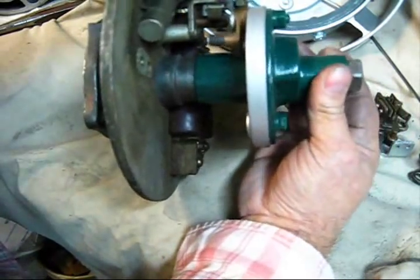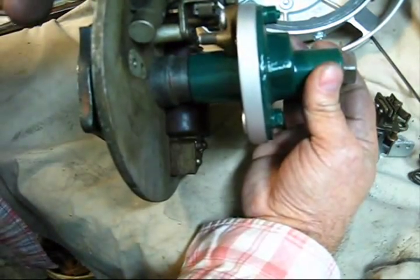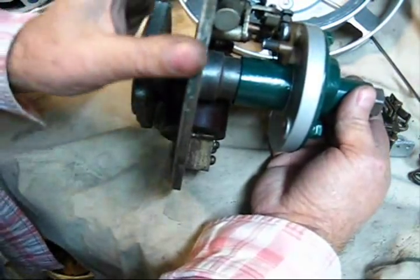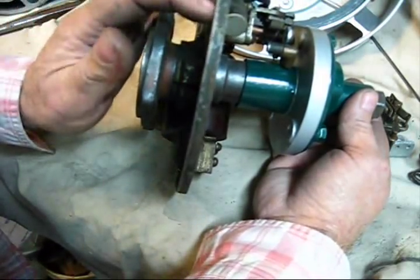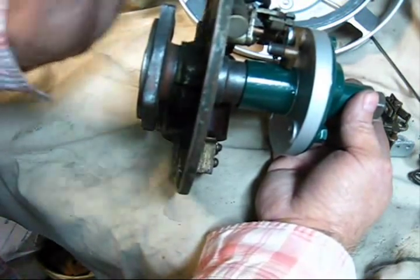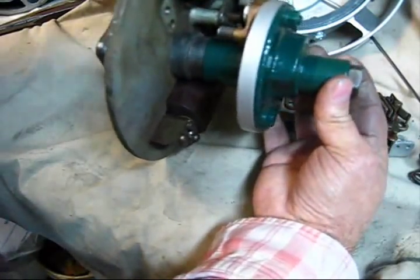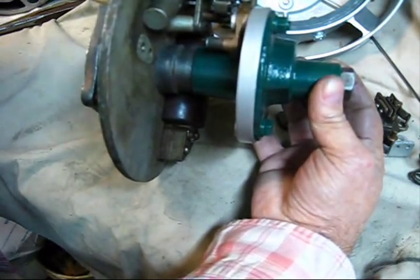The next little pin comes out — it's the replacement of this roller wheel here in its midpoint. That's important, because when you're adjusting something, if you can maintain adjustment — let's say you've got 30 degrees — if you adjust it at the 15-degree mark, then you've got 15 degrees to go either way. But if you adjust it on the 5 mark, well, you ain't got much adjustment on that side of the initial setting. So that's the reason for all of this: there is so much distance between good and bad, you can hardly go wrong.